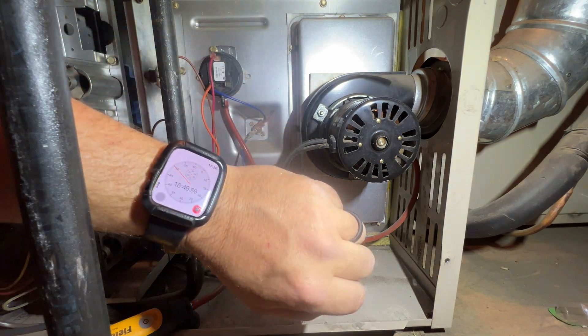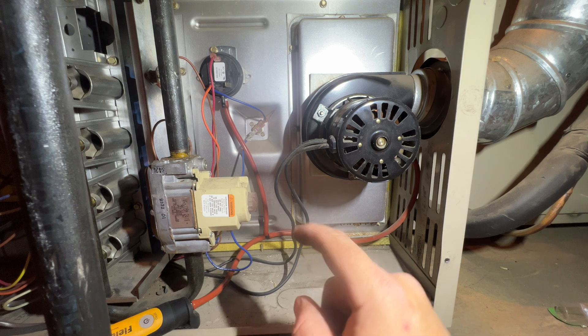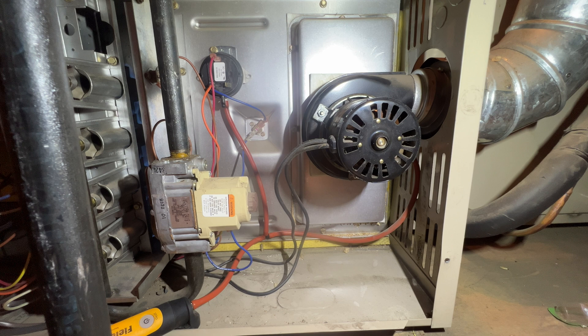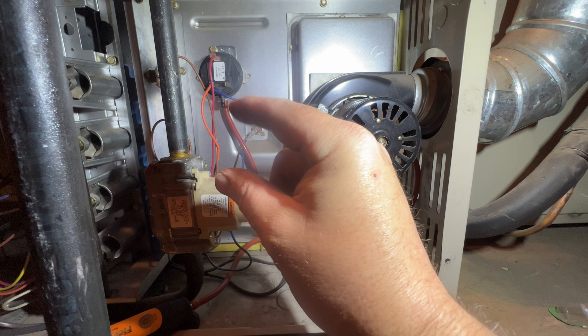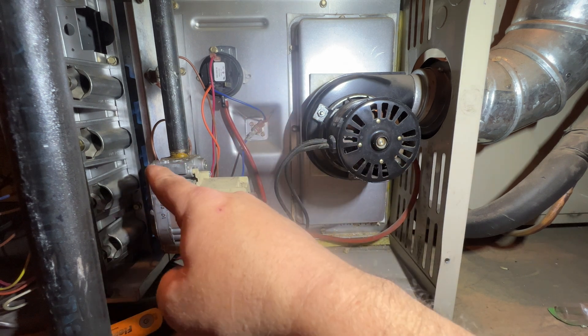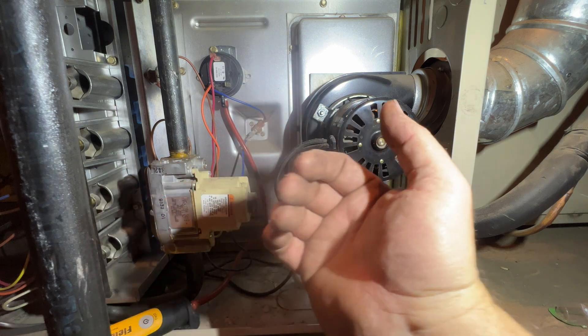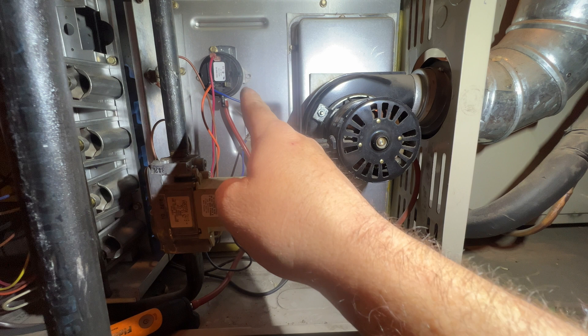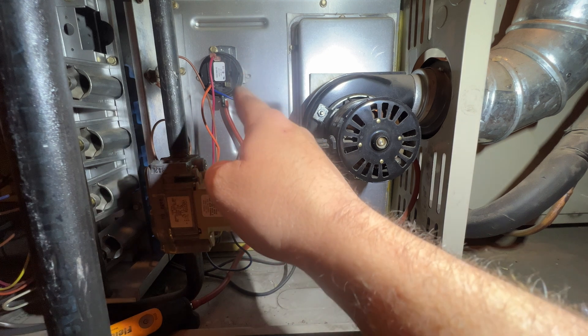She's been running for about 16, 17 minutes. So I think that was our problem — we just had a faulty pressure switch. When you come across this situation, sometimes you're going to think it's the flame sensor and replace it. But with these Lennox units, I've been finding that sometimes the pressure switch will go bad and just pop open and pop back closed real quick. So you think it's the flame sensor, but it's not. If you clean the flame sensor and it's still doing it, it's probably the pressure switch. Or it could also be a loose connection on the board. Always verify the pressure switch.